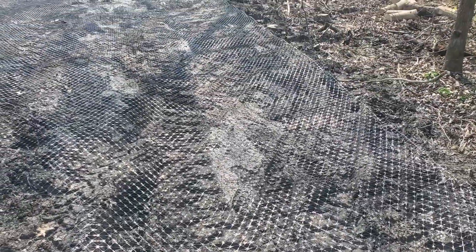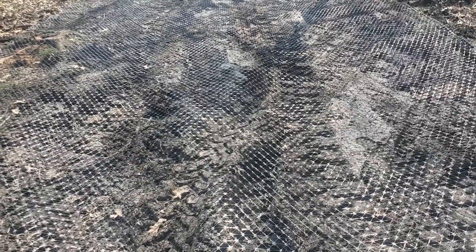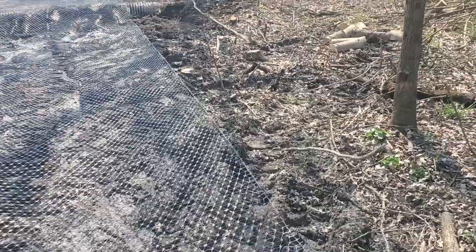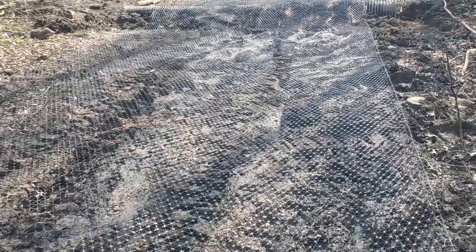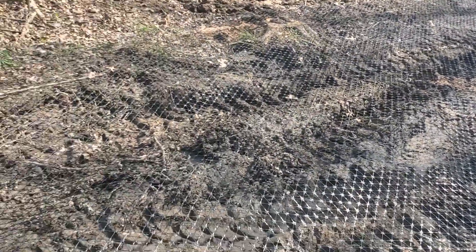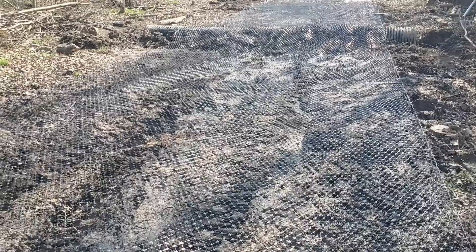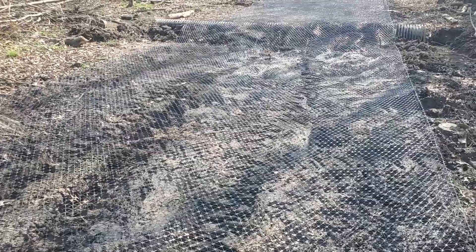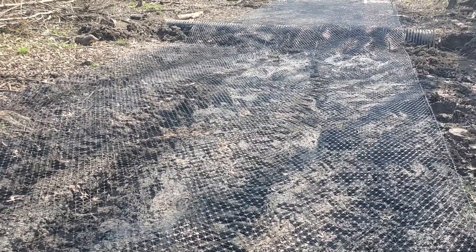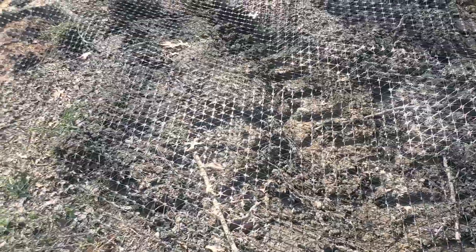I've used this material to do parking lots, driveways, and commercially. In my day job as Chief Operations Officer for a transit authority, if you have soft areas in a parking lot or you're putting in drives and roads, I wouldn't do it without this — it's just amazing. I've seen it go down in very soft situations similar to this and have triaxle dumps driving on 12, 10, even 8 inches of material right away as soon as it's laid in and tracked in. This is probably the roughest spot we've done.